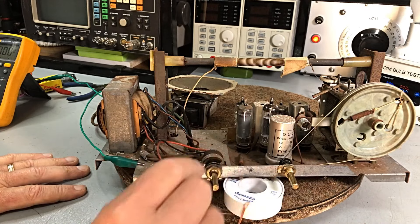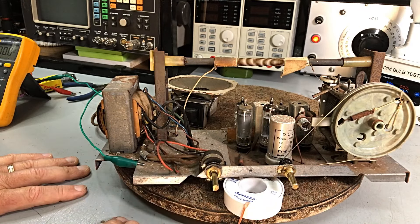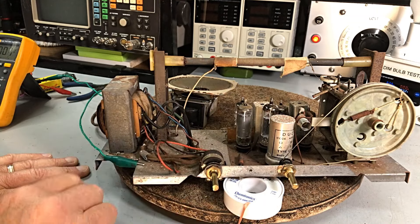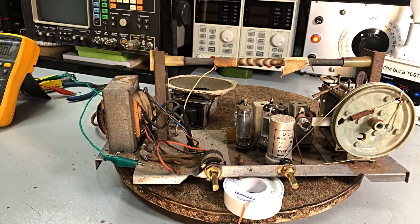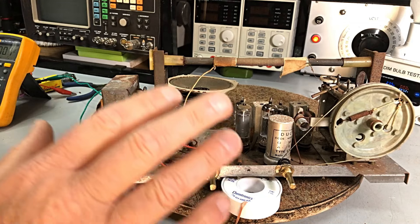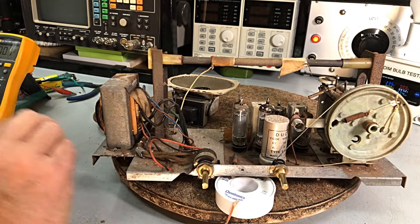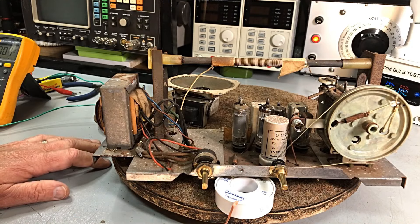So there it is — part one, the Admiral 5AW. The 6AQ5 helped a little bit, the 6X4 helped no end because the other one had just expired, and the 6AV6 was the major problem — the detector had almost no audio. Now there's plenty of audio. The 6BA6 seems to be working, and the original 6BA6 is back in there — there were no problems there, just loose connections. That's why I want to take this board out, tighten all the sockets up, and clean them. That will be part two. If you're enjoying it, thumbs up, subscribe, follow me along. I think this is going to come up rather nice — okay guys, until next time, bye for now.